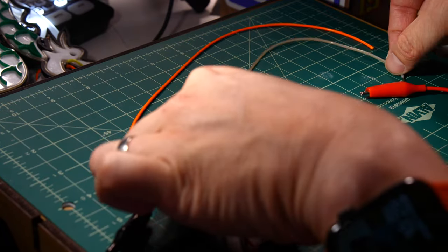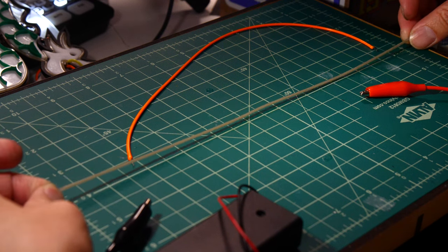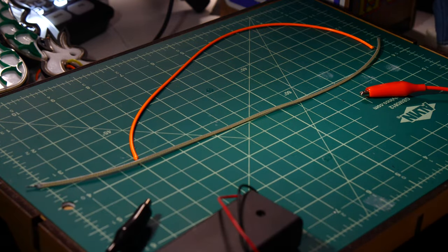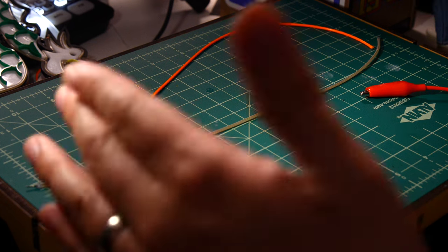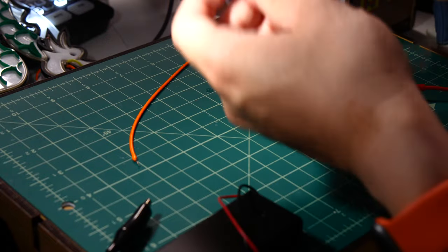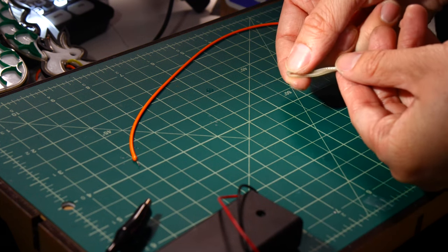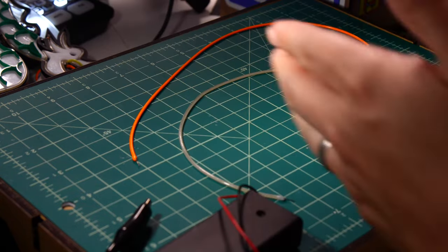What I have here are examples of what I got. Not only do they come in a longer strand — this one is about 30 centimeters end to end, so effectively about 26–27 centimeters of effective lighting — but it's embedded in this flexible silicone tubing. It's so impressive how flexible and nimble this is; you can really squeeze it like you're almost breaking the wire, something you'd never be able to do with an LED strip, and it still retains its durability and lighting. Another amazing thing: while a lot of traditionally harvested LED filaments run at higher voltages like 12 or 24 volts, these actually run at 3 volts.